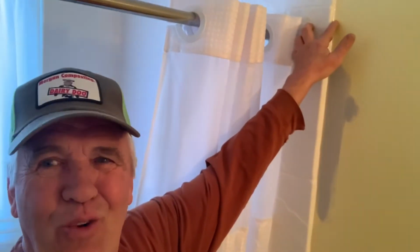How do we fix this, Bubba? Well, down on the baseboards, as you can see, I'm removing, and I'm going to put a new baseboard now, caulk it with a painter's caulk. But what I'm going to do on the rest of this is I'm actually going to caulk over top of the caulk. Now, I had a lady one time tell me, you can't caulk over caulk. The caulk must be removed. Well, that's simply not true. Loose caulk must be removed.